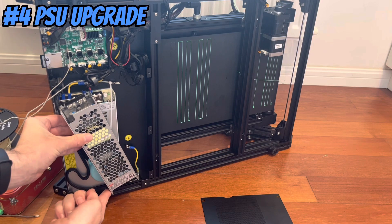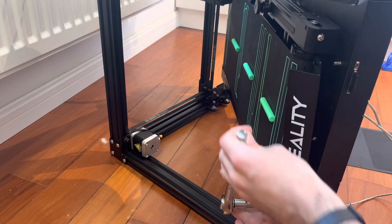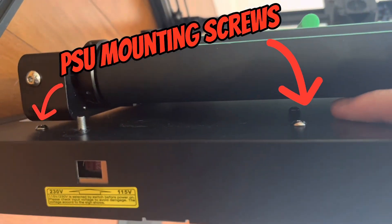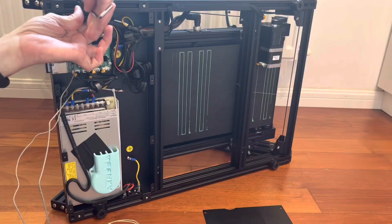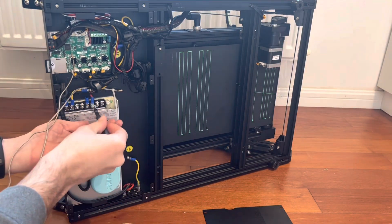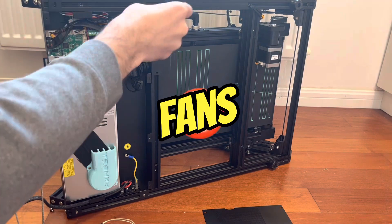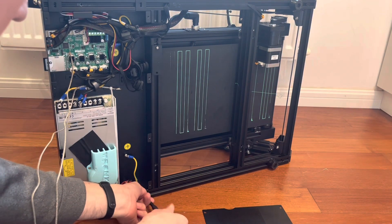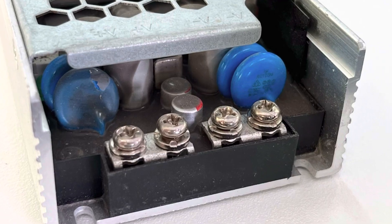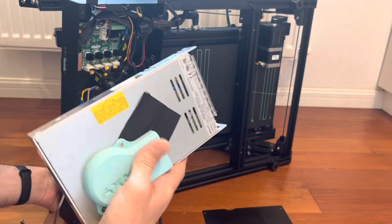This is the UHP-350 power supply from Meanwell. I'm going to be taking the power supply out and redoing the AC power wiring, which can be very dangerous and can kill you, so take all proper safety precautions — never work with AC power when the unit is powered on, and if you've never been trained with AC power this upgrade might not be for you. The first reason I chose this supply is it's designed to run in continuous operation without a fan, completely eliminating fan noise. The second reason is its electronic components are encapsulated in gel, protecting against humidity, dust, and cat hair. The third reason is it's more efficient, meaning less electricity consumption and less heat.